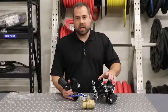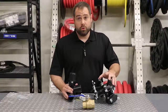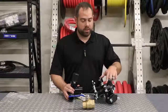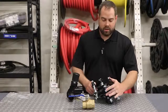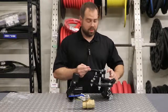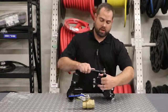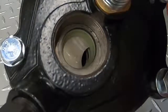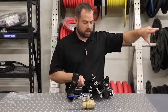We do have your disc style, which is our Plana II valve. We also have a junior Plana valve for the smaller pots — it's got a three-quarter entry instead of an inch and a quarter entry like the Plana II. The disc style valve is a disc on top of a second disc plate. There are two holes, and as you turn your lever, you can line up that hole and meter how much or how little abrasive goes into the airstream and out the blast hose.